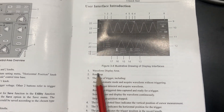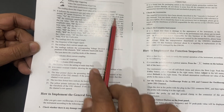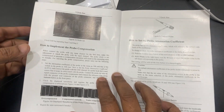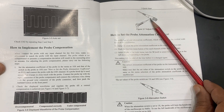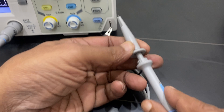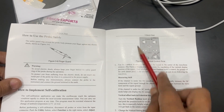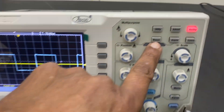The manual tells you stop, trigger, frequency, time, and other things visible on the panel, which buttons do what, and what different terms mean — what Vpp means, what T means. It explains the function of inspection, frequency adjustment, and how to adjust the probe tip with a screwdriver. There is an x1 and x10 selection on the probe — you can see this selection there. Mostly you should use x10, because otherwise the input impedance will be affected.